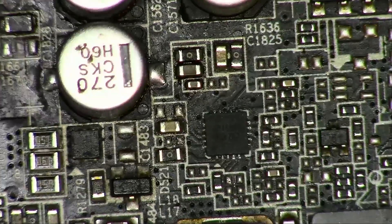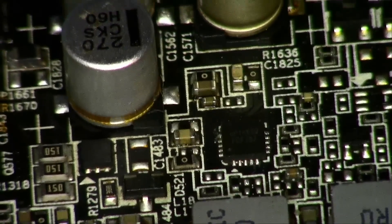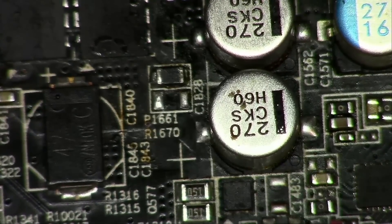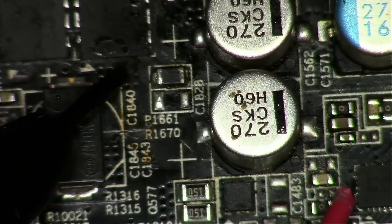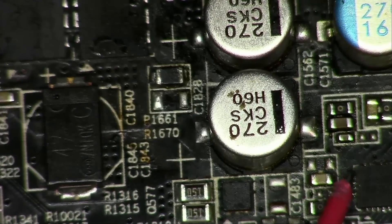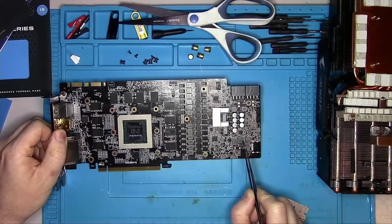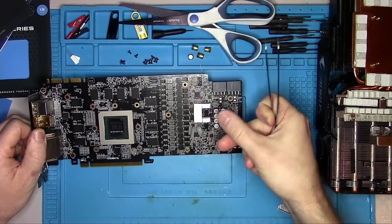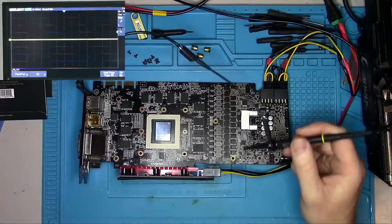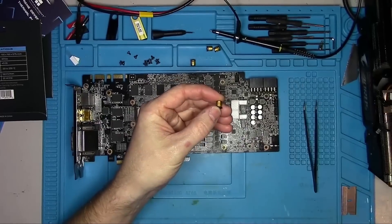Next on the list is the controller that controls those MOSFETs. Let's see if it makes any good connection to the MOSFETs by checking for resistance on pins that are supposed to go to the gate of the MOSFET. All looks good, and because there's no way I can swap phases on this controller, I'll just swap the controller and see if it helps. Sadly that did not help either. The only thing left was to mess around with the capacitors — specifically these two right here. I had them swapped and for whatever reason the signal became normal on both phases. I expected the good signal and the bad signal to swap places, but instead they're both looking good. Strange, but okay — not going to complain about that.